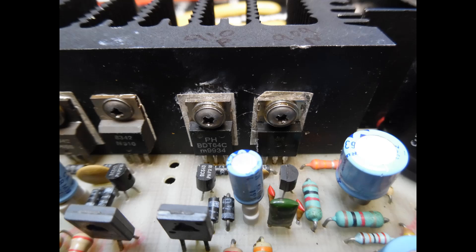Because this is a very early device from the 1970s, the board is not marked with component reference numbers, which is probably how the error originally occurred. I've replaced the output transistors with the correct type and corrected the poor solder joints on the underside of the board to restore the integrity of the solder connections.